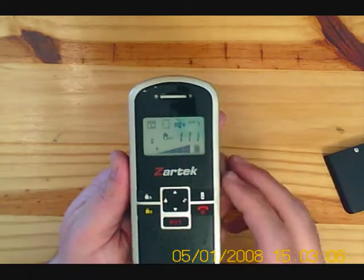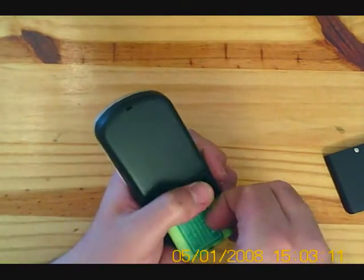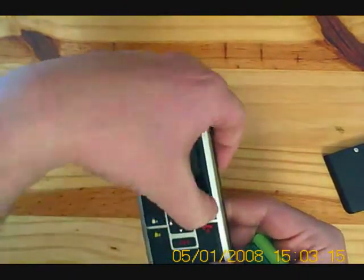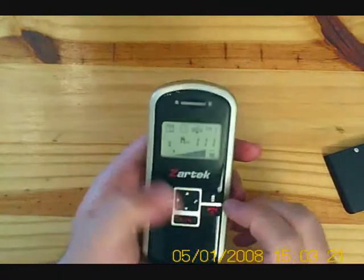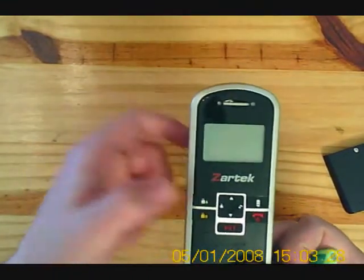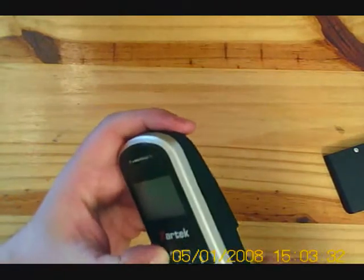Let's choose channel 4 as per our gate station. Remove the battery, press and hold in the handset calling button on the top right and insert the battery. Now we can use the arrow keys to select our channel — channel 4 — and remove the battery. To enter into programming mode, press and hold in the A button while inserting the battery.